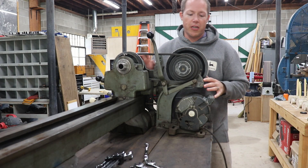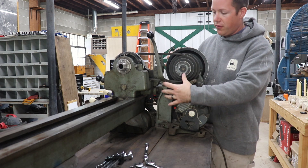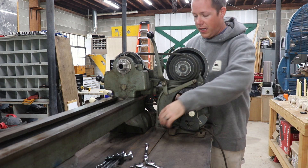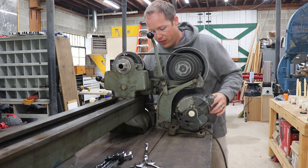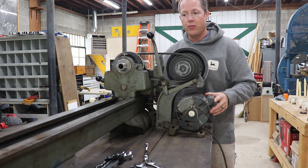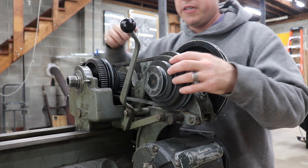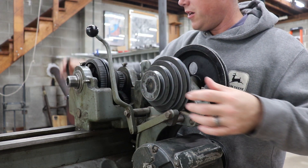For today's project I'm going to remove the motor, the counter shaft, and the counter shaft assembly. This is all a separate unit from the lathe and it's bolted down — it's supposed to be bolted with four bolts but it looks like we only have one or two in there. We're going to get all this removed and start cleaning it up, and then maybe move on to removing the quick change gearbox off the front of the lathe. To get rid of this belt I'm just going to release the tension on it and then it comes off easily.